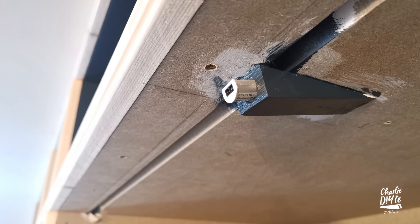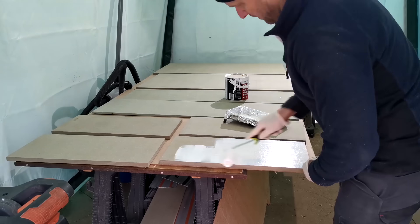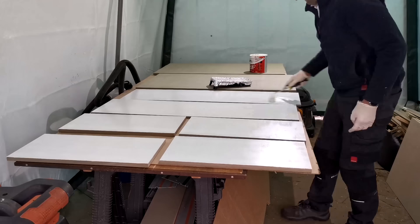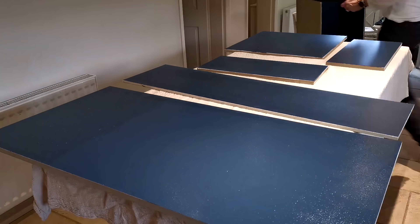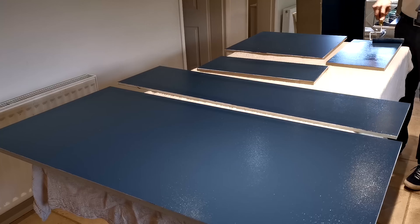And so we're on to painting. What I've realised is that if I'd been really organised I would have painted each individual section of carcass before putting it together, but I wasn't, and at least these carcasses will be relatively easy to paint in situ. I did paint around the sensor housing and LED strip connector input before installing those lighting components. But the top boxes would have been a complete pain to paint afterwards, so with all the components cut I set about priming them with Zinsser BIN one cold wet evening in my tented workshop, then top-coated them with Johnstone's acrylic eggshell mixed to Farrow & Ball Hague Blue.